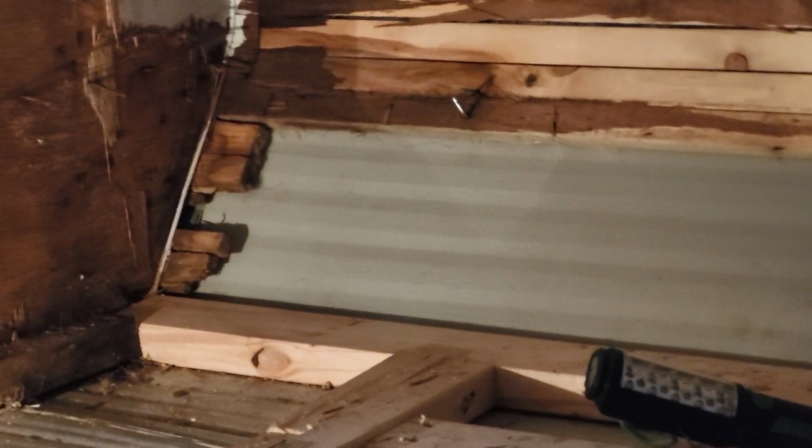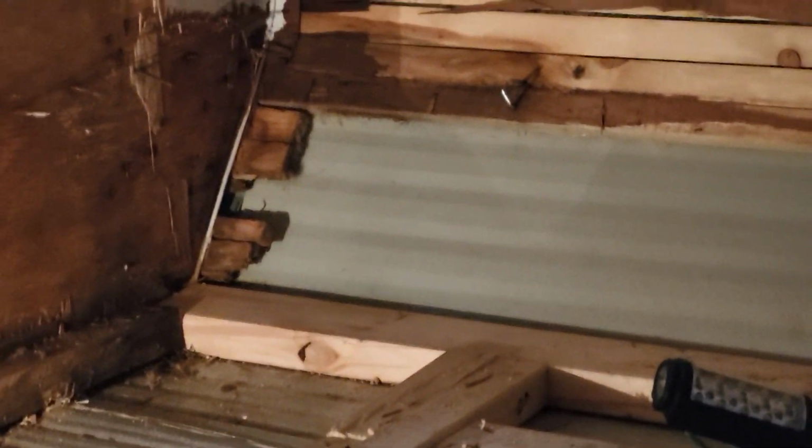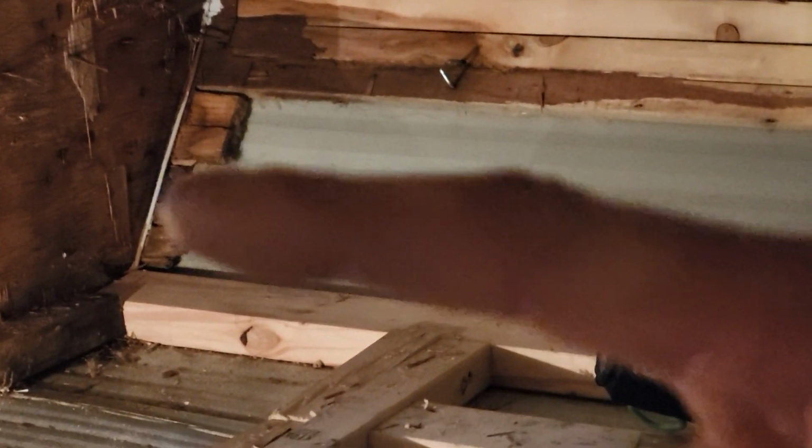And I cut the piece of plywood to be 3/4 of an inch away from the walls. I'm going to put a piece of 3/4 inch plywood on the end of the long piece of plywood and screw that into the... So if your plywood is... I don't have a block to show you an example on. If the plywood is flush with that wall, the piece of plywood is going to come up like that, and it's going to screw into the wall, into that wall like that. 1, 2, and 3, just for some extra structure, and the same on that side.